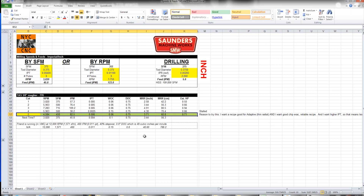This is the cut I think we're going to like. I'm backing the surface footage back down to 450 surface feet, or about 4,500 RPMs, and increasing the chip load per tooth. That puts us at 82.5 inches a minute. The higher chip load per tooth means the cutter is more engaged into the material and it can actually stabilize your cut more. Same width of cut and depth of cut — about 3.7 cubic inches a minute. I wanted to get to four, but let's take a look.